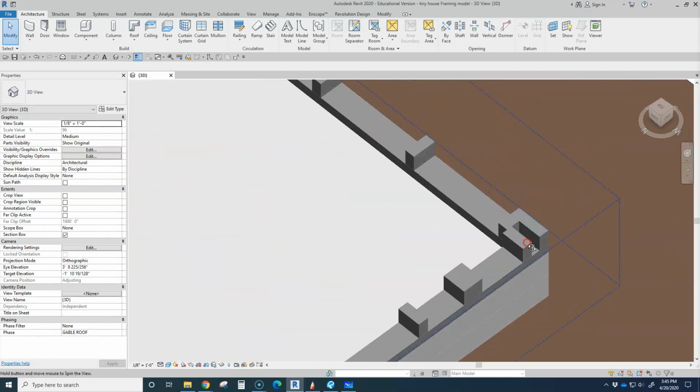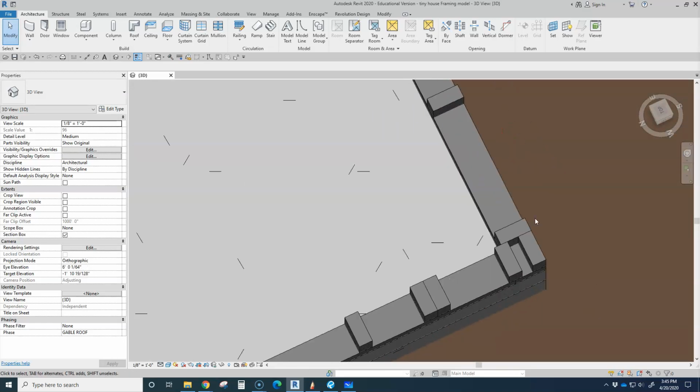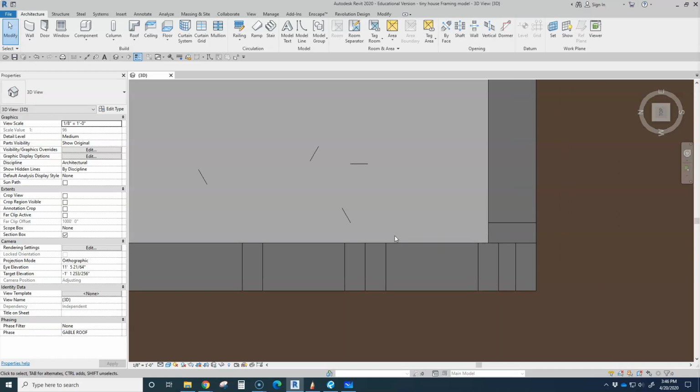But also be mindful of the corners. In corners, there's actually 3 2x4s, and I'll describe why. So there's going to be a 2x4 here, and a 2x4 here, and a 2x4 here. And this 2x4 is so that when the stucco guy comes and wraps the stucco around, there's something solid to nail to. This 2x4 and this 2x4 is here for the drywall, really. So you're going to have drywall coming down in here up to this line, and they'll nail it this way. And the next drywall will come about here and go that way, and then nail this way. So on the corner, it's really important to have some solid wood for other materials to be nailed to.